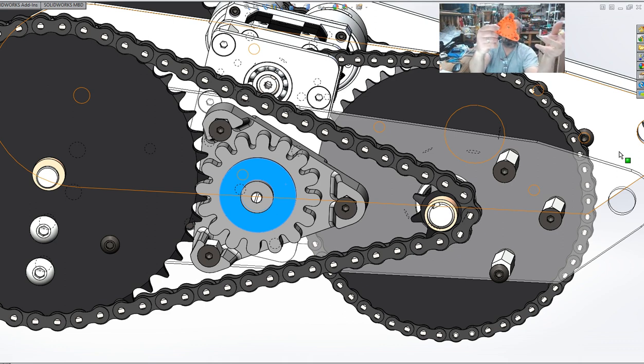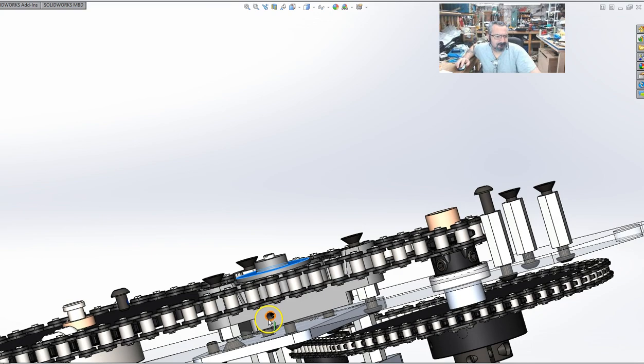Then it's just a matter of figuring out what you screwed up, putting the tracks back down into position, and then retuning this potentiometer. How do you do that? Well, you simply go in here, because there's a hole in the side of the cradle base. You can access this pot like this, and you simply turn it until you get it retimed. The wires for the pot exit out the bottom, which is in the CAD. It is down here, right there.